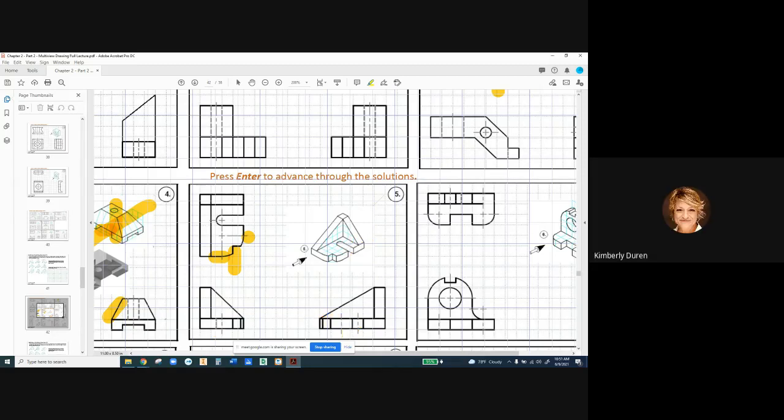I showed the back of the notch in this primary view right here, and then I have the visible edges of that notch right here. Once again, I have a plane all the way across because I'm going from a vertical to an angle. So anytime we have 180 degrees all the way up to a full circle, we have a little mark for the center, and then we show the legs extending beyond the circular object. We have a little gap to our legs and they go outside the circle, showing that it's not geometry. That's what we call a bullseye.